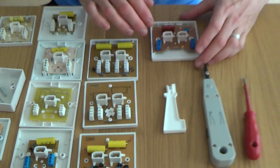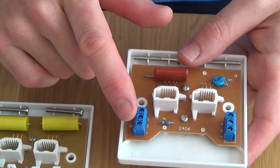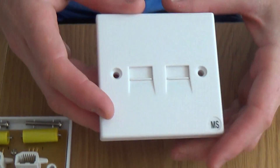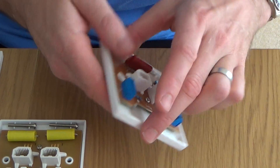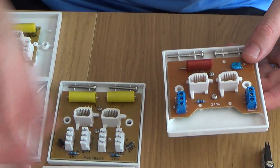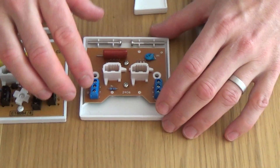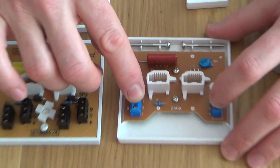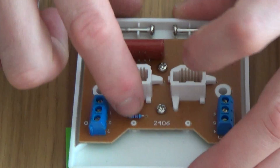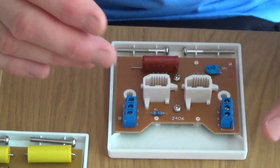The five series has two socket outlets but only one telephone line — it terminates one telephone number but allows two devices to be plugged in, essentially the same function as a double adapter. These aren't widely used since a double adapter achieves the same result, but some prefer them for neatness. This example is a 5/4A — mastering components with screw terminals. Without mastering components it would be a 5/6A; with just the capacitor a 5/5A; and with IDC connections instead it would be a 5/1A.